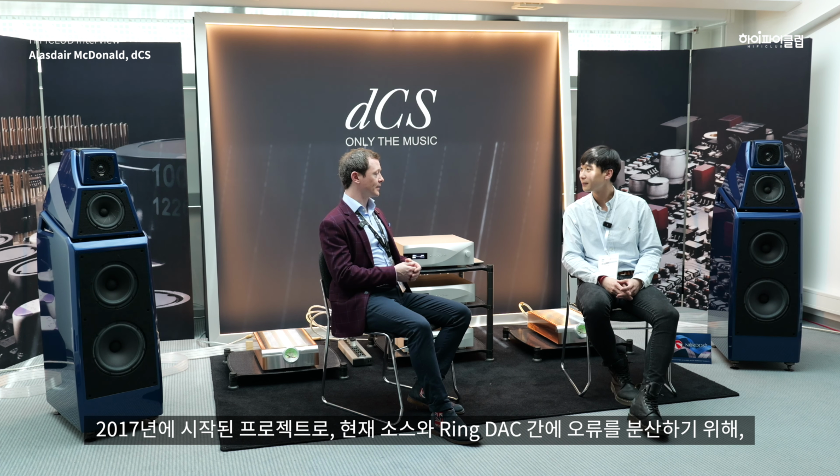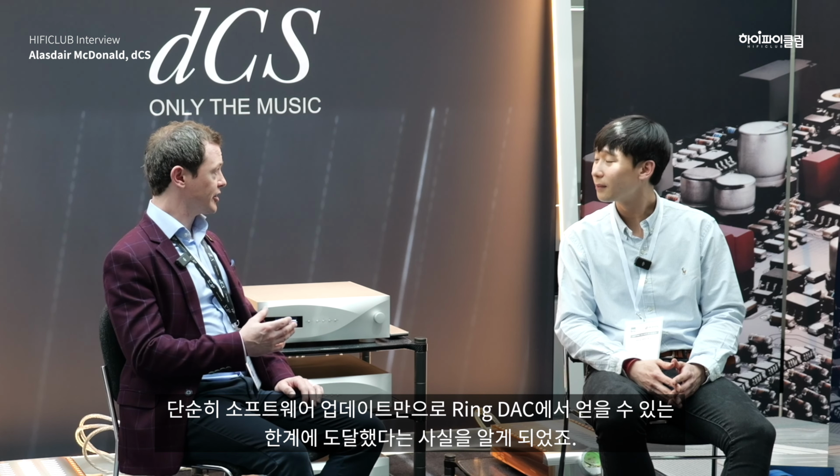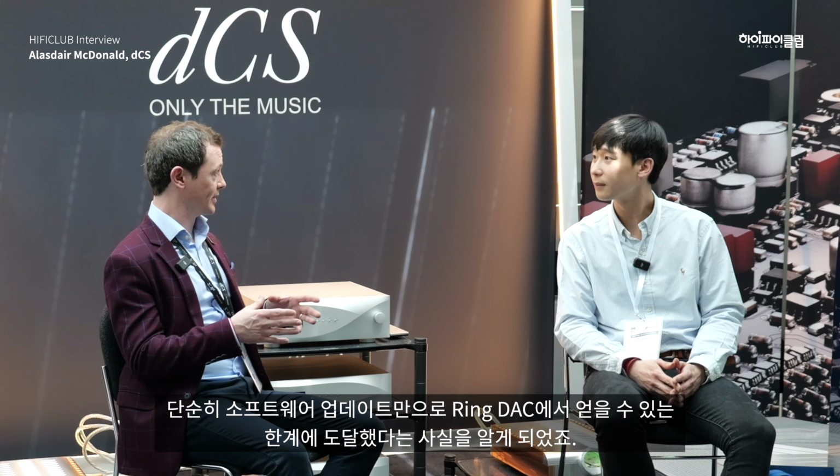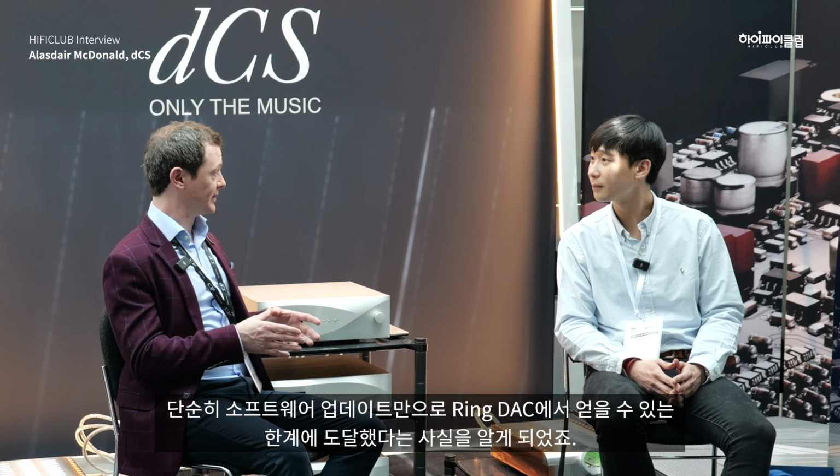Of course. APEX is our latest revision to what we call our Ring DAC board. It's a project that started way back in 2017, with updates to how our mapping algorithm works to distribute errors between the current sources in our Ring DAC. We found when we launched our 2.0 mappers that we'd really reached the ceiling of what was possible to get from our Ring DAC board in simply software updates.